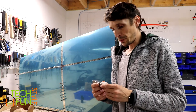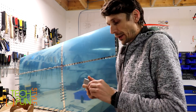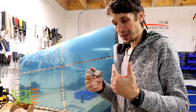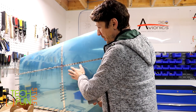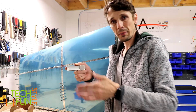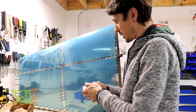One important thing I found from my own experience with a bucking bar - I actually read about it after I discovered it. When riveting any rivets here, we use a bucking bar and attach it to the inner surface of the skin. When we hit with the rivet gun from one side, it obviously hits the bucking bar, and the bucking bar replies with the same force - F1 equals minus F2. By doing that we are placing the rivet. But what happens with the back side of the bucking bar? Whenever we push, the back side hits our skin inside and bends it.